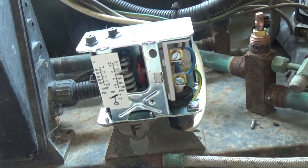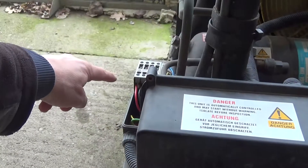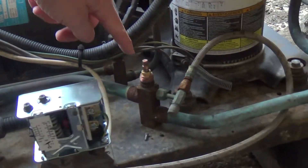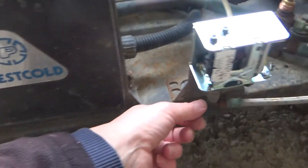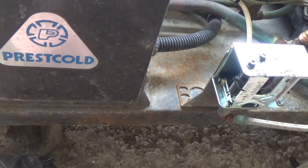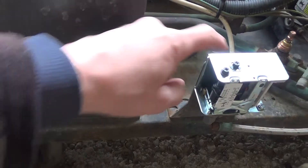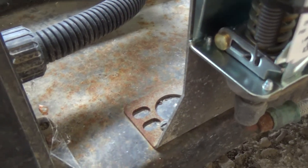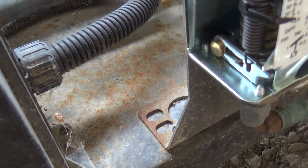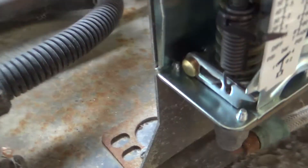Got that swapped over. What I did was hold the contactor in so it would pump down, and then shut that valve off. So this was probably under a slight vacuum — we weren't going to damage the bellows with the pressure. It could over-expand without this mechanism sat on top of it. I don't know what pressure that's going to come up to, if anything. Let's see if we can get this cracked open.